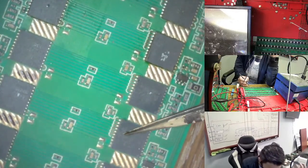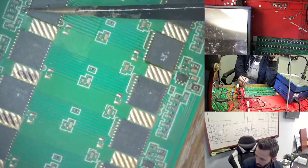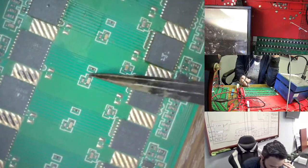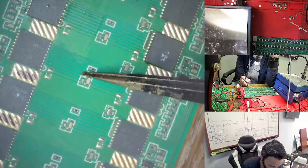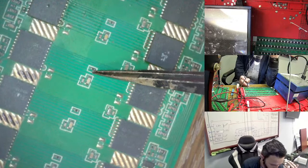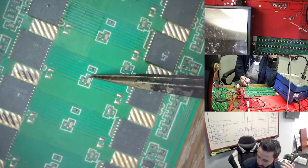So what I'm thinking is, where's the clock? Because you have the crystal, so if you have the crystal you're supposed to have the clock. But one more thing: if you see this capacitor, it gave you 1.5. This is for sure the return back, 1.5, because we launch 12 volts. And this one is 0.7. So this is the clock.